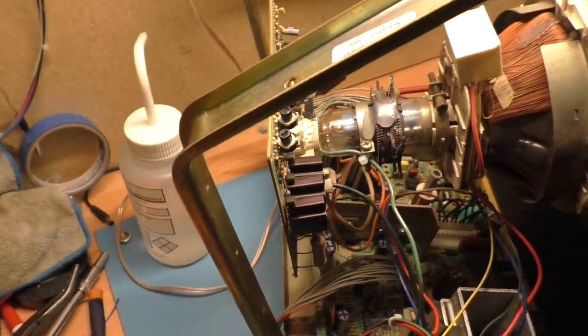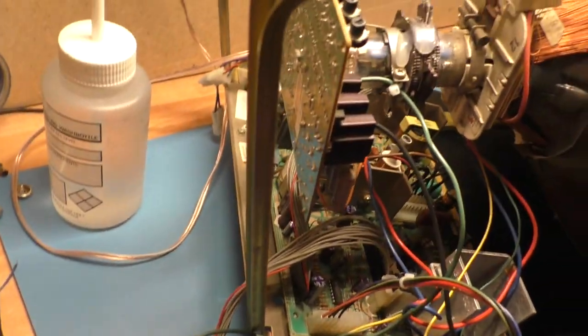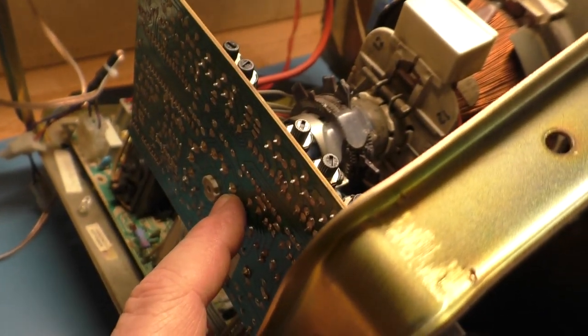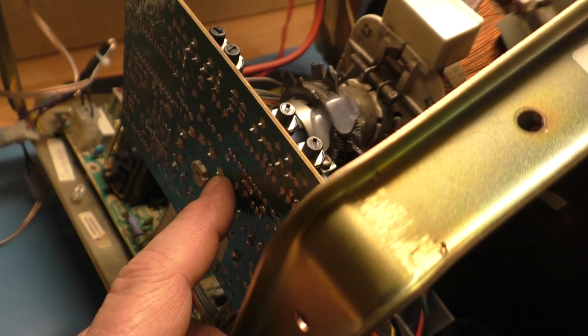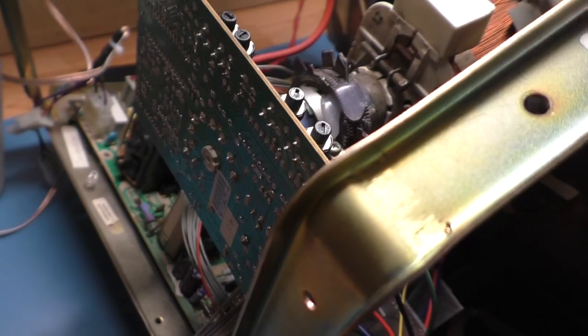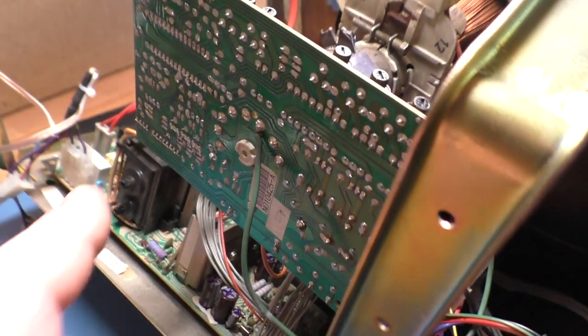So what we need to do now, turn this off, turn that off. And we need to solder that wire directly to pin 10, which I'll do here. I have to use two hands, so I'm gonna set the camera down. Actually, just probably just turn it off. And I'll come back with that wire soldered to the neck board and we'll test it again. Okay, successfully soldered to pin 10.